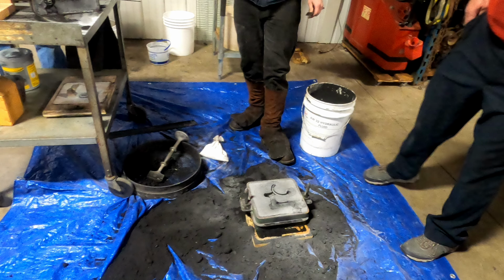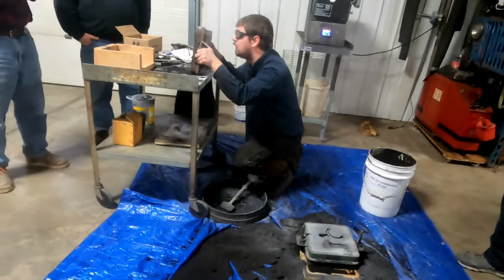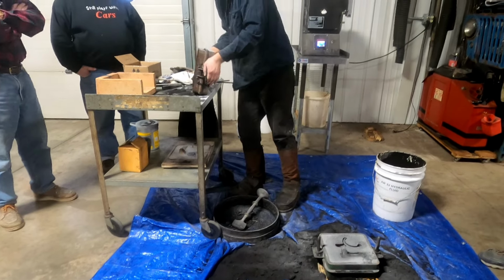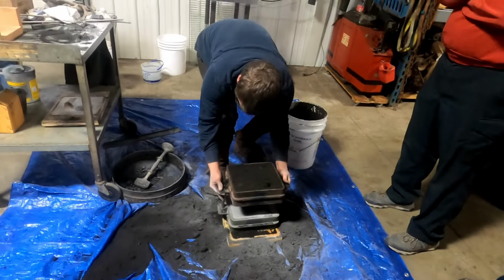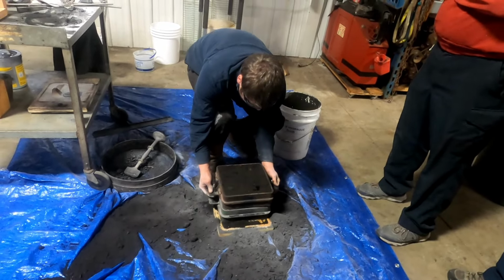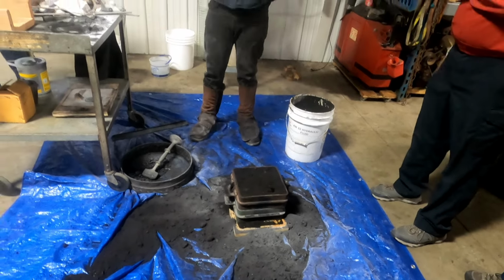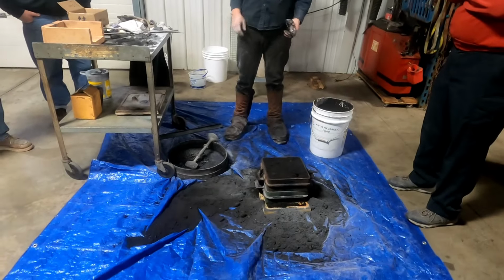So, I'm gonna put my lap gate in right now. So I'm gonna come halfway over and I'm gonna dig in there. All right. So now, I'm gonna lift my mold over here. I'm gonna go horizontal. We're gonna come straight down. We're gonna close the mold. That mold is done. All right. Nice work. And that's green sand molding.